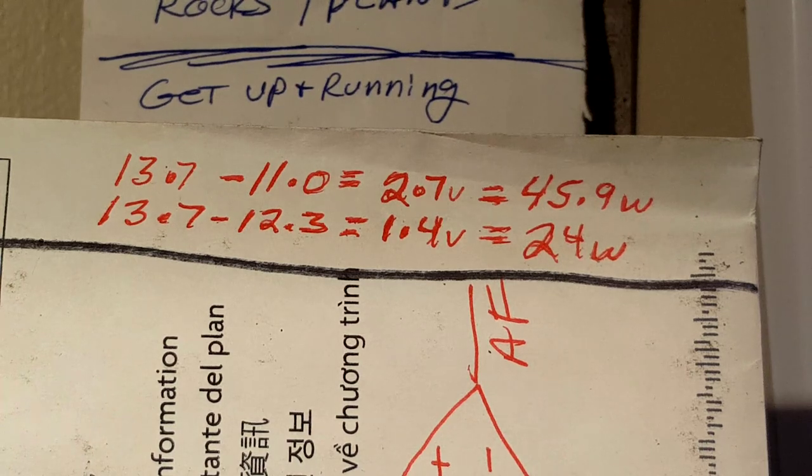The stock power cable dissipates 24 watts along its length — that's excessive in my opinion. It's real wasted energy and it could be reduced greatly. If Yaesu would have used 8 gauge wire instead of 10 gauge — or ideally 6 gauge, nice supple soft copper — it should be two gauge sizes larger than what it is. You can do the same by making up your own power cable for your rig.